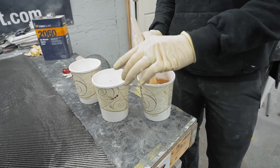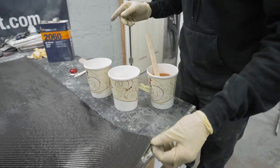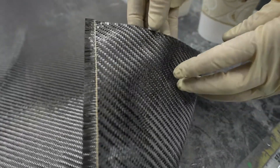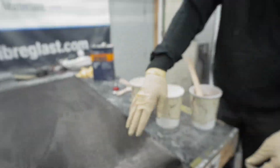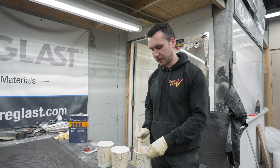When we lay this first layer of carbon up, we're going to lay it with the veil side up. The side that actually faces out on the mold will be the other side. You shouldn't see the veil once it's already wet out, but just in case, put the veil side up — it's not facing against the mold.